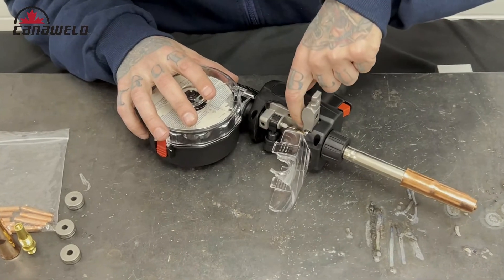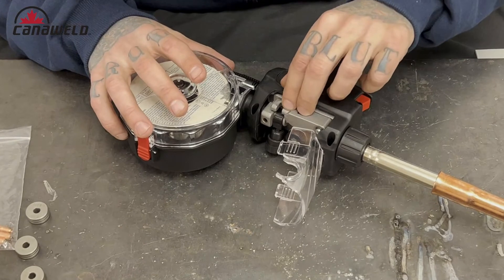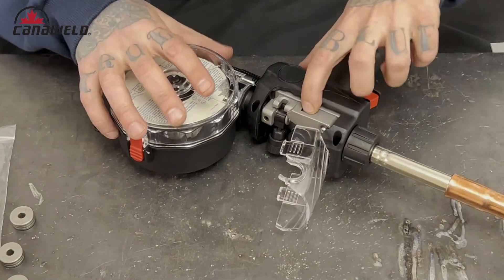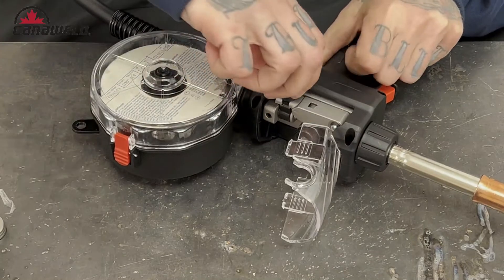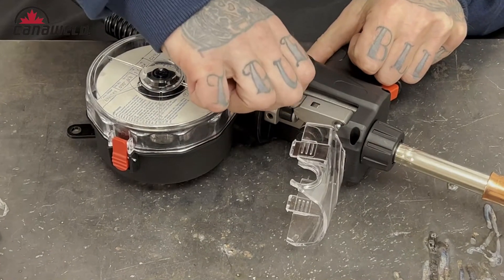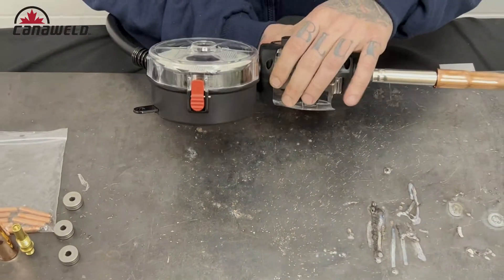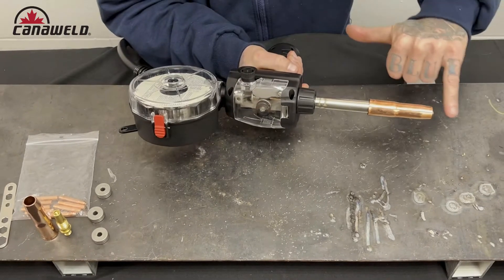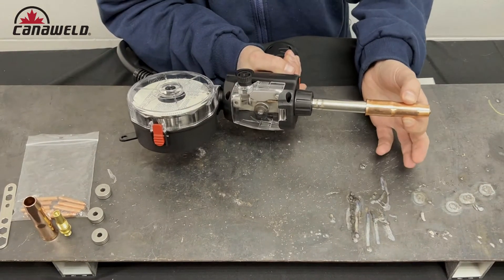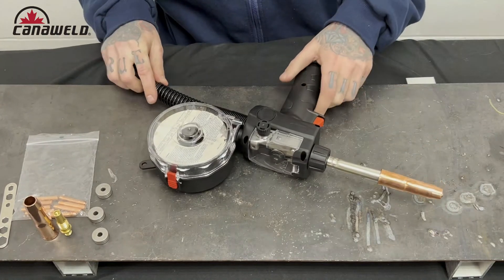Take a pair of pliers and slide it into the sleeve. Once it's in the sleeve, lock it down so the other roller has it sandwiched. Adjust the tension — right now it's at max. Close up the top, squeeze the trigger and it's going to start feeding and run through. No problems because I've got the right 030 tip, and that's all you've got to do to load one of these things up.